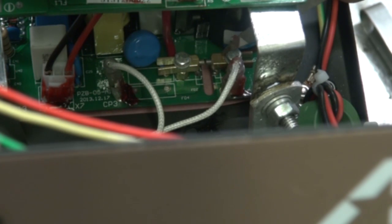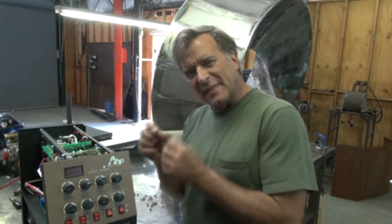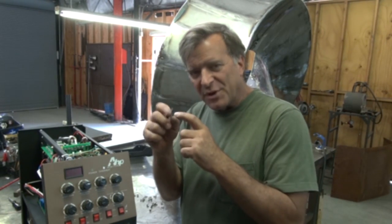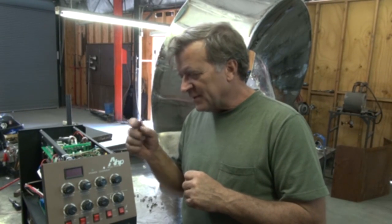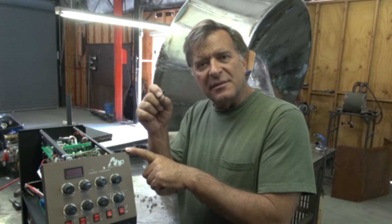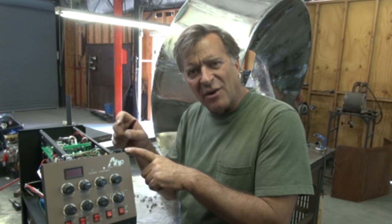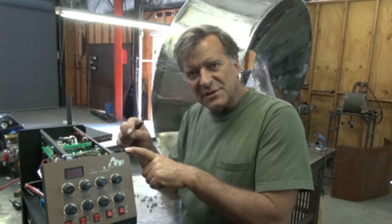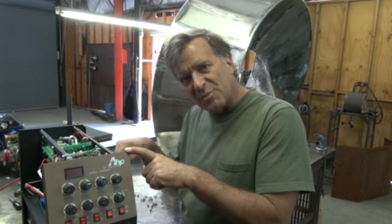This will come back into play again. So what happens is, as the electricity jumps across those points, they get burned a little — just like the points in the old-style ignition systems on cars where the contact points would burn a little, just from age and from use. So what you'll find is, if you all of a sudden find your TIG welder is getting harder to start, the high-frequency is getting harder to start, you've got to get closer to the metal, or you even have to touch it sometimes just to get it to start. What's happened is the contact points have gotten dirty.